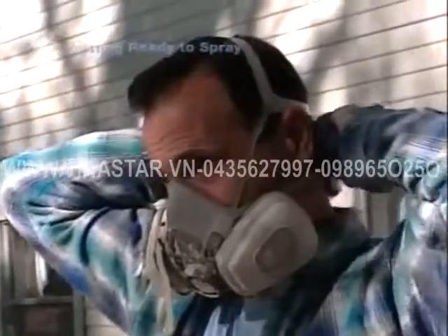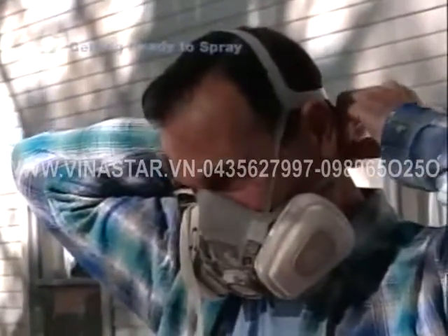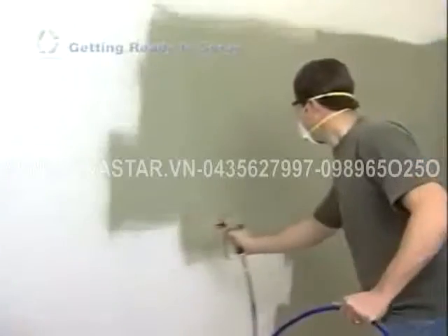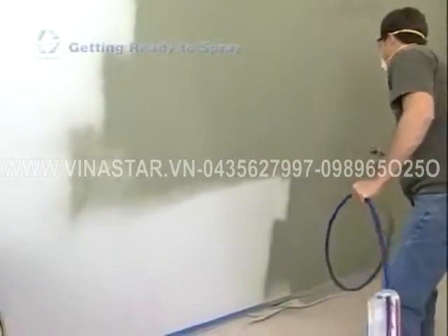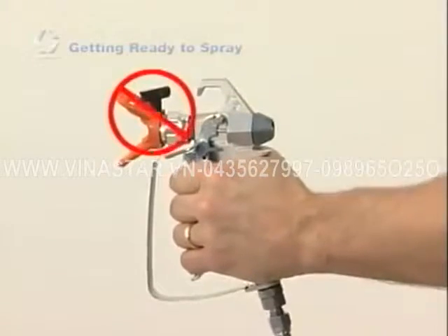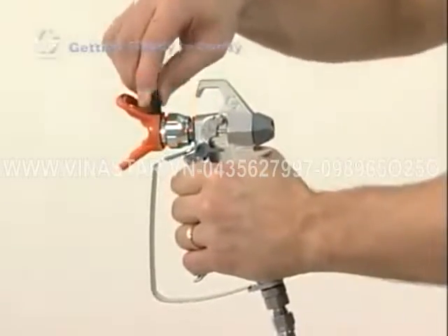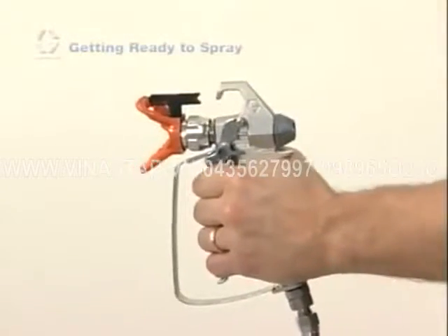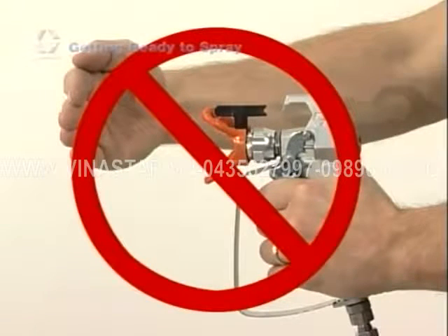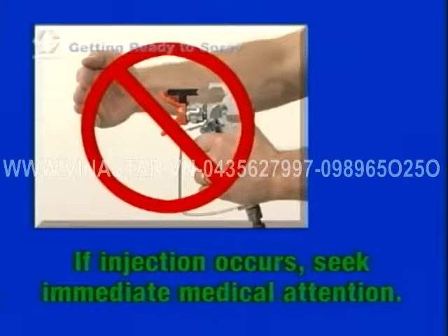The last step — safety — is one of the most important preparation steps. Read the operating manual and review all safety precautions for your paint sprayer and the materials you are spraying. Use your equipment only in a well-ventilated area. Never squeeze the gun trigger when the spray tip is between the spray and unclogged positions. The tip should be secure and completely inserted in the guard housing and pointing forward. Never put your hand in front of the tip and never point the spray gun at yourself or anyone else. High pressure fluid can pierce the skin and cause a very serious injury. If this happens, seek immediate medical attention, even if the injury is small. Injection injuries are very serious.